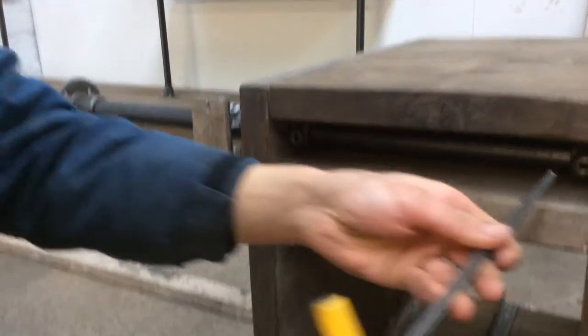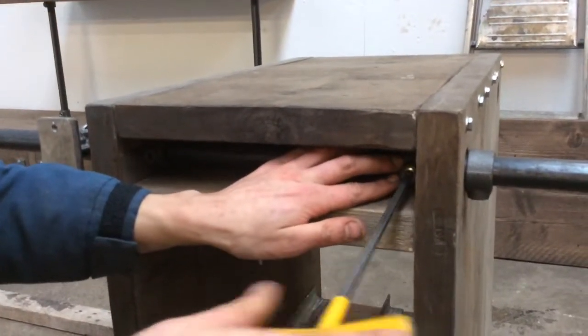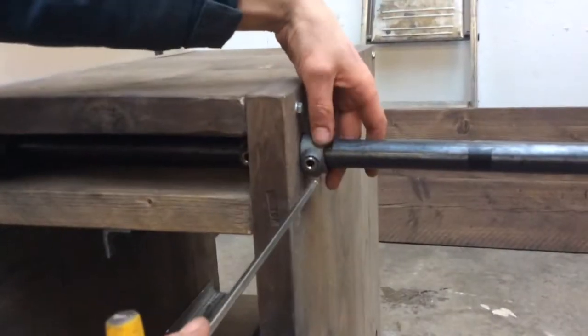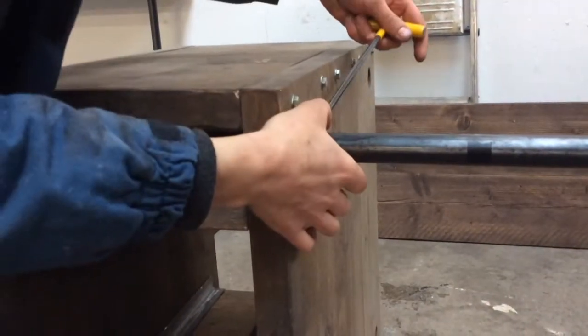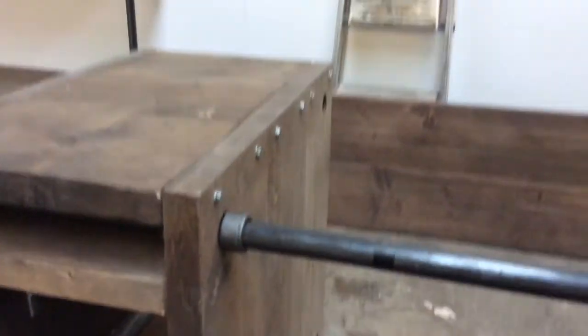Now we're going to lock these in. Obviously these are fairly substantial pieces of timber, so we just want to lock these up and make sure that it's nice and secure. Face these ones this way. Notice our case is just facing this top one, facing forwards towards the front edge of the unit, so that when it's up and assembled in place, we're going to be able to see those screws as a nice feature on the item.